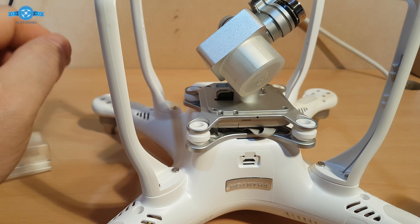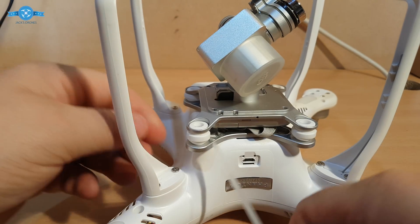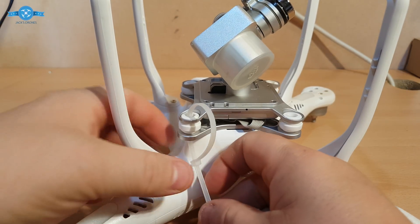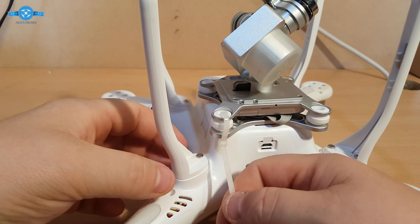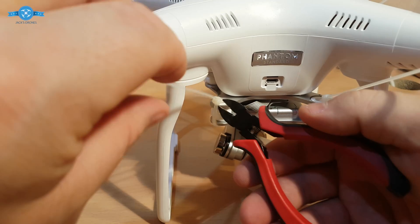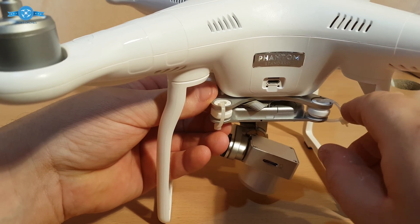You can get these plastic lugs and buy them — they're only about a pound for a pack of four. Unfortunately at the moment I don't have any, but with all my drones I've used white cable ties. I thread them through like this — it works just as well. The plastic thing is just to hold the gimbal so it doesn't break off the dampening pads; it doesn't restrict or tie it down, it just makes a lock between it and still allows it to jump up and down — a bit like cable ties do. So it saves a pound. Just tie it enough so there's still a bit of play, because this has got to jump around to take all the vibrations out. And this holds this on so that if it breaks off in a crash, the cable ties will keep it together. When I do these repairs and the customer has only got two plastic ones, I actually fit cable ties on as extra as well.